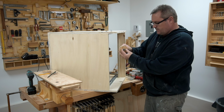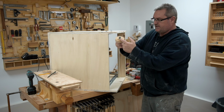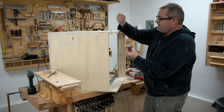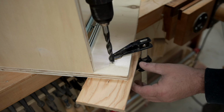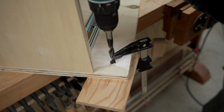And the way this works is I've got 3 washers on the outside here, you could say, underneath the head, and then another one on the inside. And then there'll be a nut that goes on here as well, plus another washer, and all of that will thread into a T-nut that goes in from the outside of the cabinet. And that'll lock everything together and make everything turn freely.